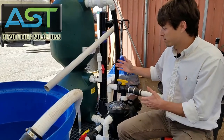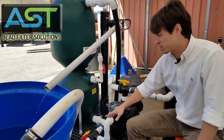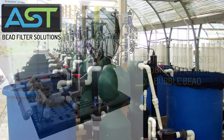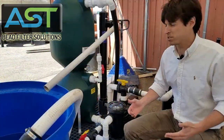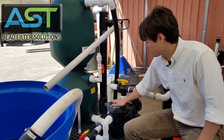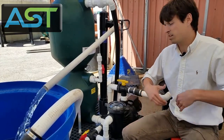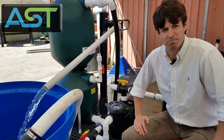It's important to note that this filter, when it's skid-mounted like this, has clearance for pallet jacks so it can be moved around to multiple types of systems — recirculating aquaculture systems, seafood holding systems, aquaponics systems. There are a lot of options for this system, and it comes pre-plumbed. My pump is now primed and here's my return water. That whole process takes maybe a couple of minutes — it's the bubble bead backwash, also called the pump assisted backwash. Stay tuned for more videos to come. Thanks so much.